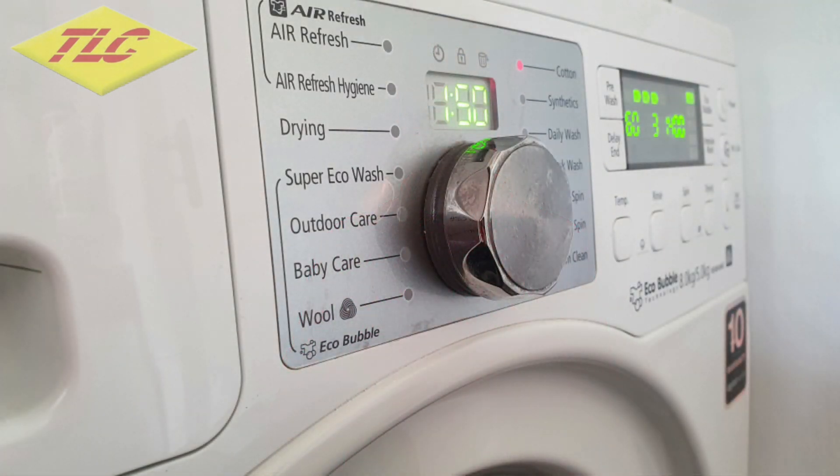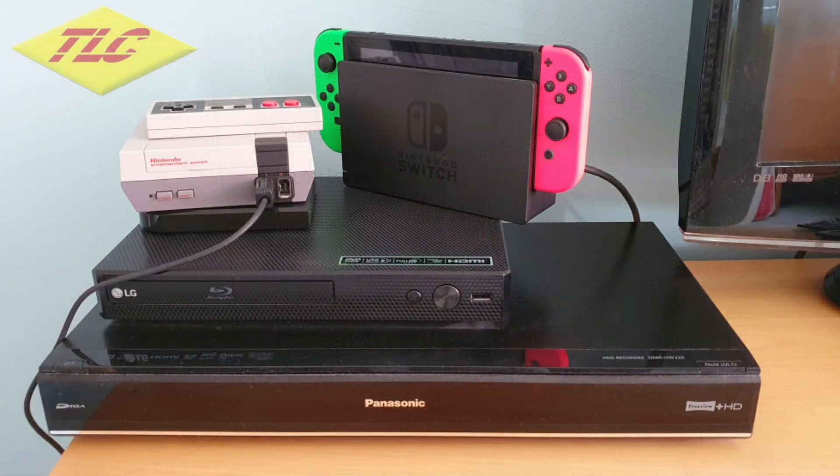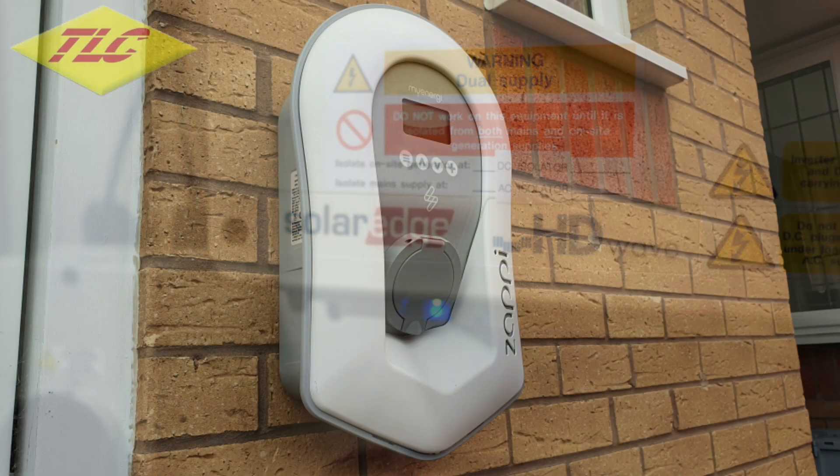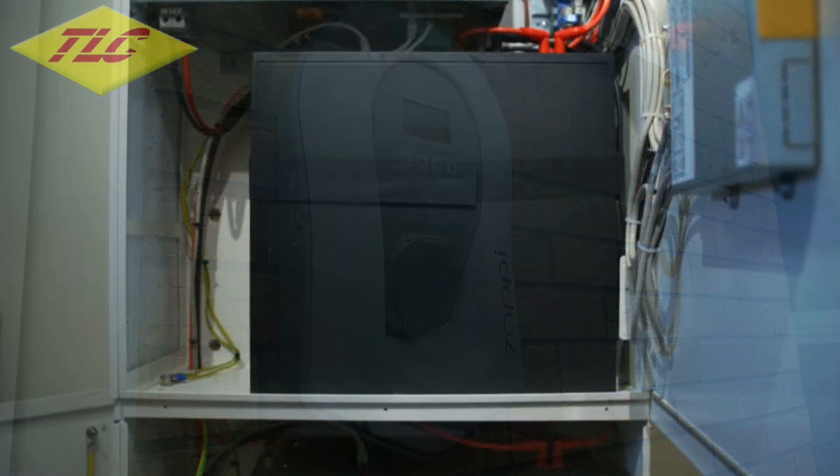You may be thinking that your house or the installation you're working on doesn't have any fancy loads that are likely to leak DC into the system. But we're not talking about mystical or exotic loads here — we're talking about things like washing machines, electronic loads like entertainment systems, and things like that. And it's only going to increase as we get more and more things like photovoltaic inverters, EV chargers and battery storage systems.